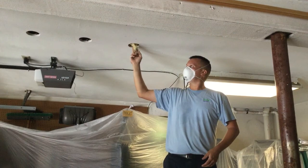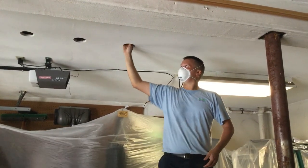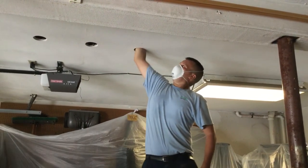A mere 6 inches of fiberglass insulation originally installed leaves upwards of 18 inches of empty space for cold air to circulate, robbing heat from the room above.